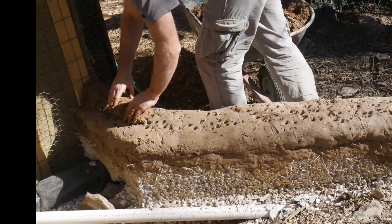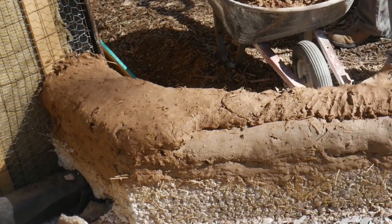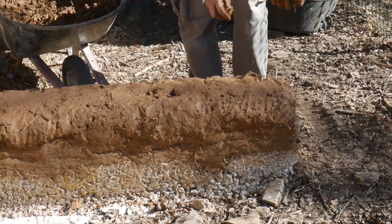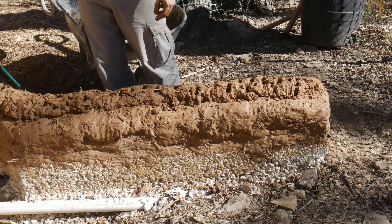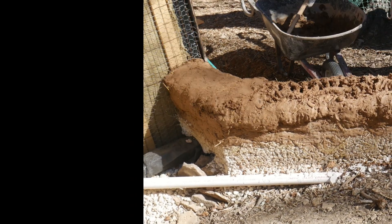This is a time lapse of building one of the retaining walls. I could only go up 6 to 8 inches at a time. You can see the wall bulging out here when I was trying to get a little ambitious one day. It was sunny and dry, so sometimes I could get away with putting on a course in the morning and then another in the late afternoon. For a couple of weeks, I would cob for about an hour a day and then do other things like work on the earth tube system — more on that in a few minutes.